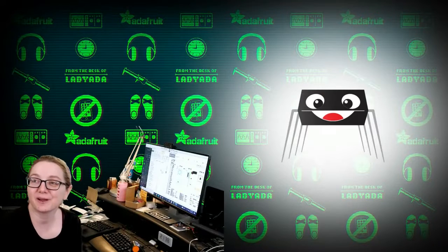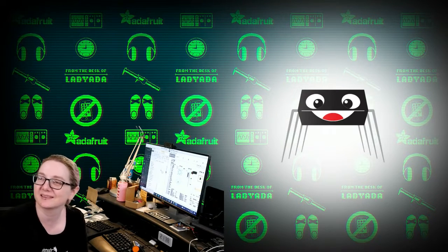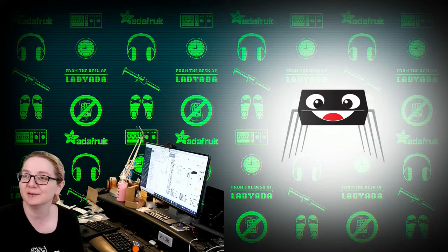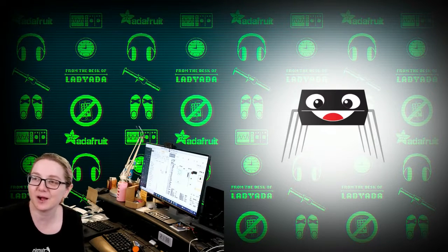We're going to be talking about the 555 timer this week. Lady Ada, what is a 555 timer? A 555, also known as a triple nickel, is a special chip that I think was invented in like 76 or so. It's an all-in-one non-microcontroller chip that can be used for timing purposes or oscillator purposes.